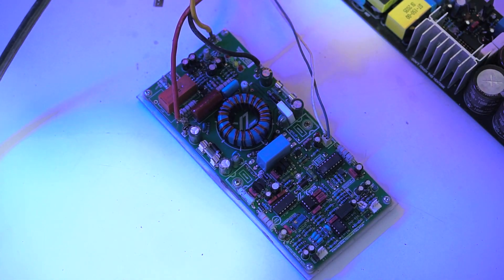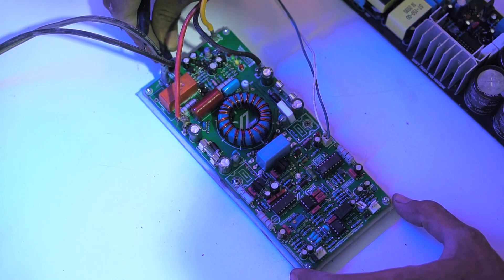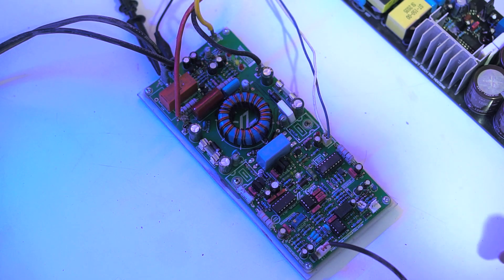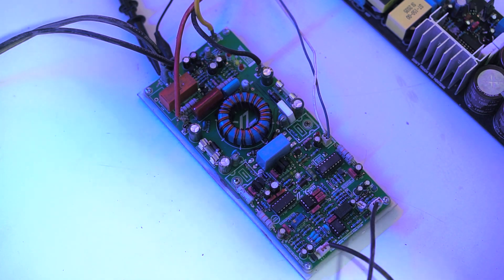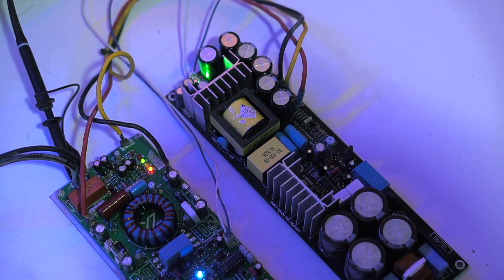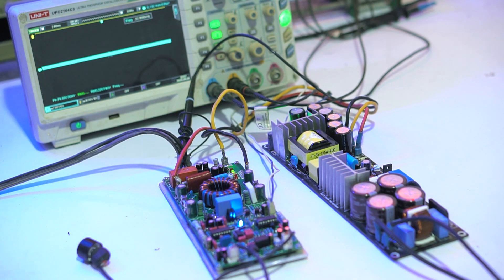For the initial test, I will test the sound first using a 15-inch speaker and tweeter. I connected an oscilloscope to the output terminal to monitor the output signal. For input, I am using unbalance mode so J3 is jumpered. I connected a potentiometer — a mono type, 10k–50kΩ. Turning on the amplifier: the OCP light will briefly turn on then off, and when it turns off the speaker relay will activate. I connected the input directly to the laptop soundcard and played music.